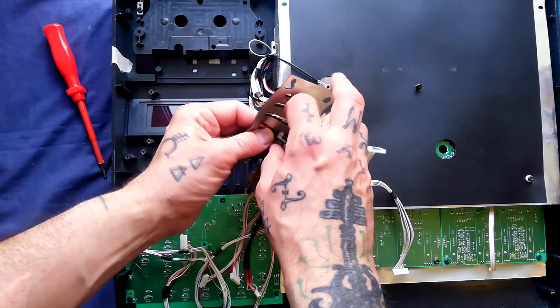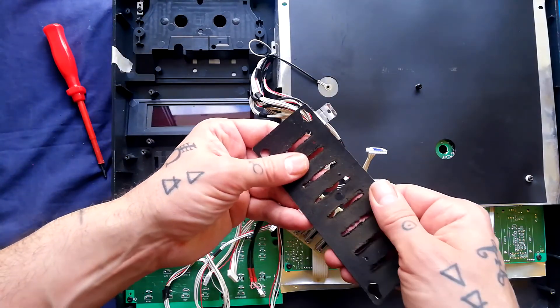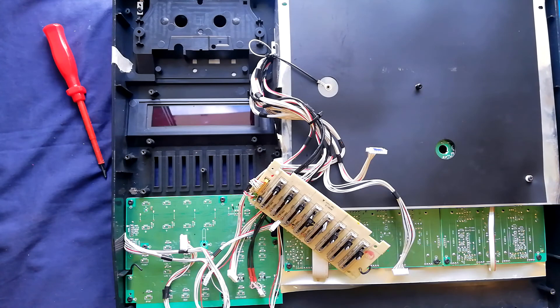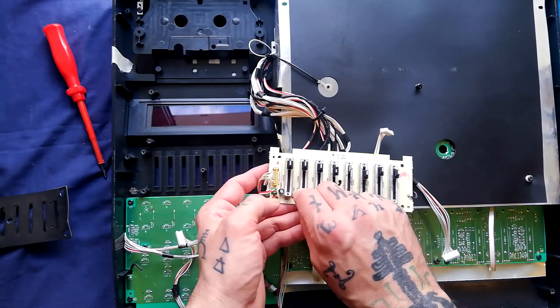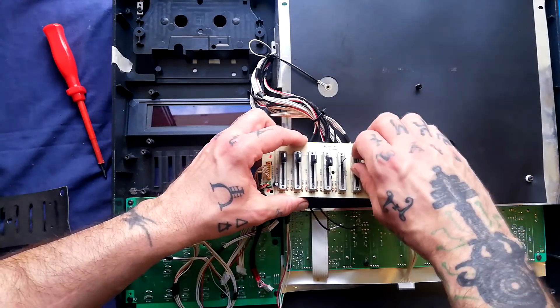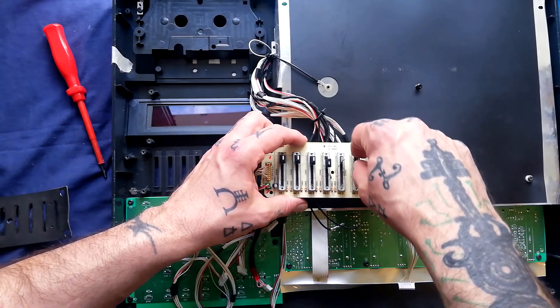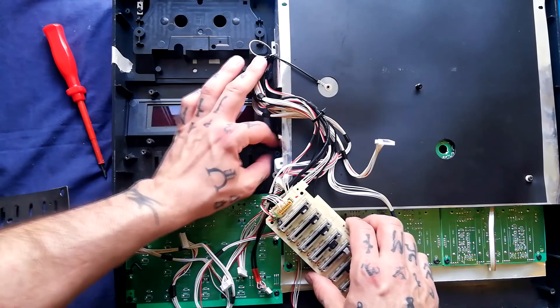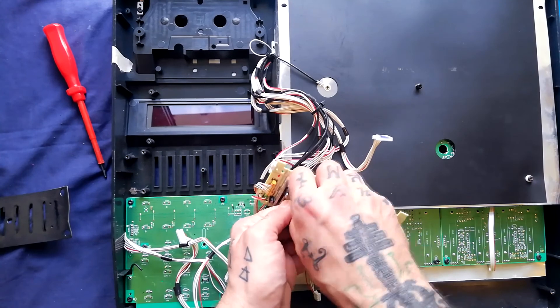So this is shielding. I need to be careful because there's a certain amount of foam rot there — it's not too bad, but I'm going to crumble most of that away because we don't want debris from that dried-up decomposing foam getting into the faders. These faders are already looking pretty dirty so I need to give them a good clean. What just fell off there seems to be an extra plastic retainer thing so the fader knobs don't go too far down. I'll take those off now and put them in the little plastic container where I'm cleaning all the knobs.